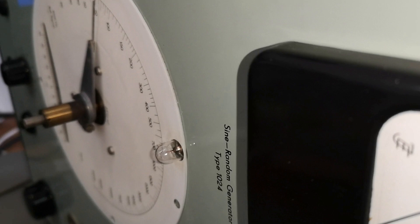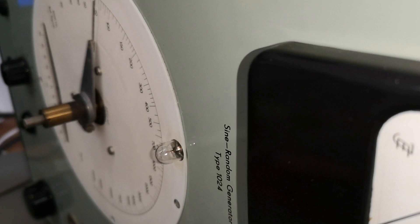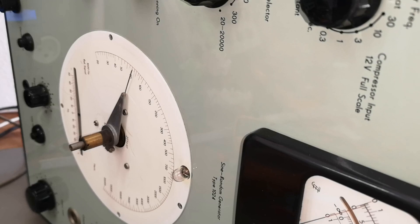I'm putting in a 12 volt 2 watt bulb so it's not glowing too powerful. The other one is 6.3 volts 300 milliamps — that's actually two watts — so I'm a little bit worried this is too bright. That is why I wait to put on the glass to see how it looks.